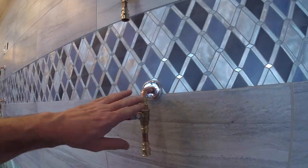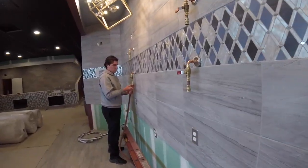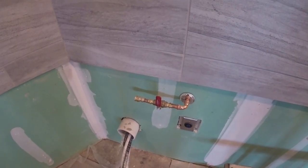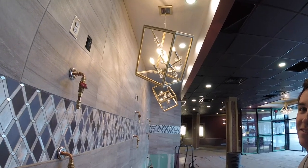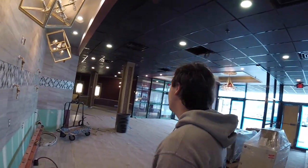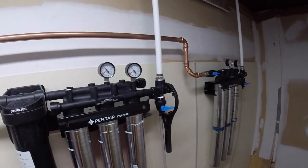Here's our system — three lines down low, the three up top are for the ice machines. The three low ones are for the Coca-Cola freestyle machines, and CB2 is purging them. And this low one is for slush — a slushy machine. CB2, it worked, built pressure right back up — now it's back on 60.